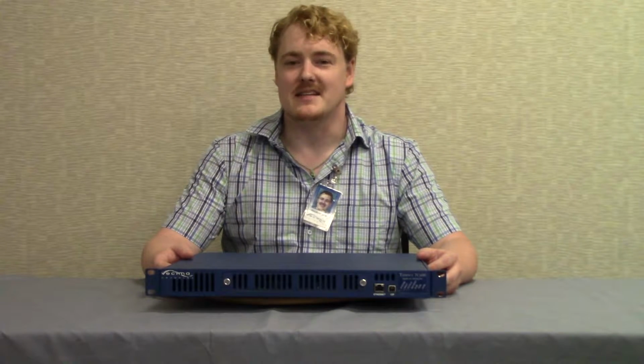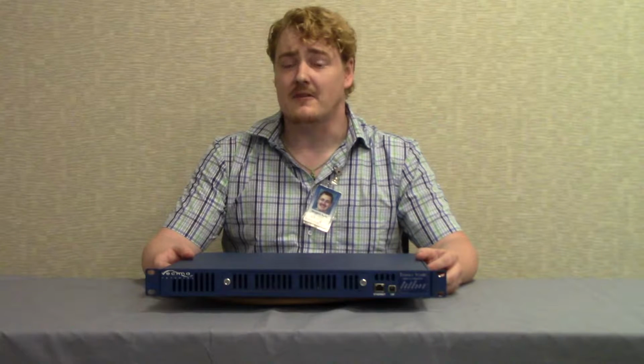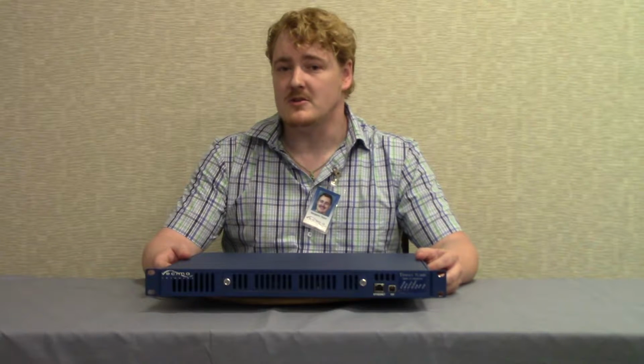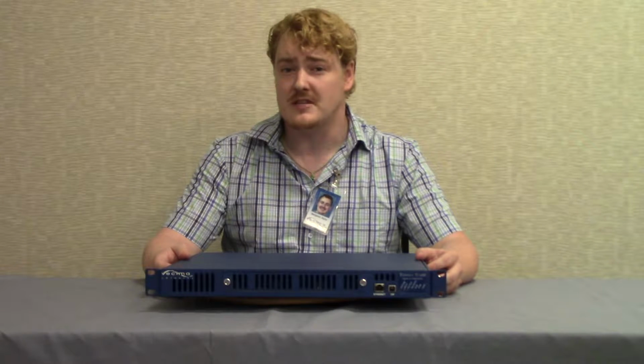Today we're going to be discussing the TC600. The Terrace TC600 is a multi-channel QAM to analog RF converter designed for indoor installation. The TC600 is deployed from a cable node to an MDU and acts as a gateway between the cable operator's distribution network and the customer's premises.